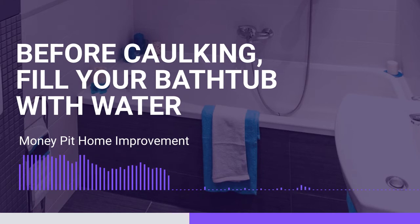So what you can do is sort of fake it out. Here's what you do. First of all, get rid of all of the old grout, the old caulk. Make sure it's really clean. Then fill the tub up with water — fill it up as much as you possibly can. Water is very heavy, it weighs eight pounds per gallon. And make sure that area where you pulled that grout or the existing caulk out is really dry in there before you go and refill it, because you don't want that extra moisture back there when you re-caulk it.